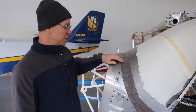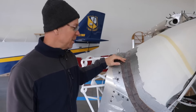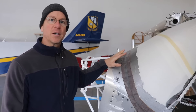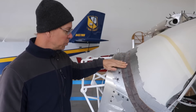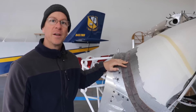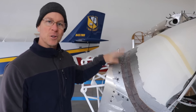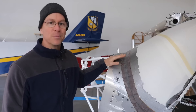The next step is Len and I will mix up another batch of resin — we call it peanut butter because it's the consistency of peanut butter. It's just resin with a whole bunch of micro balloons and flox and stuff like that in it to make it really thick. That big thick coat goes on here, and once that's sanded off this will be pretty much perfectly smooth. Then I'll pop it off, trim the edges, and it'll be ready for primer and paint.